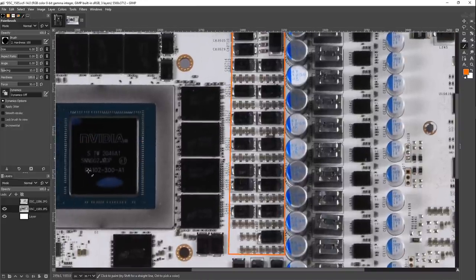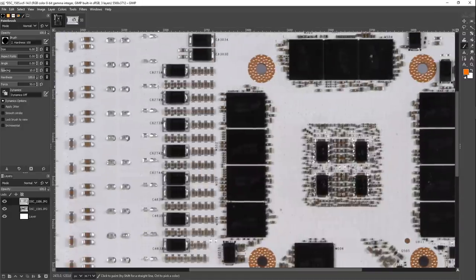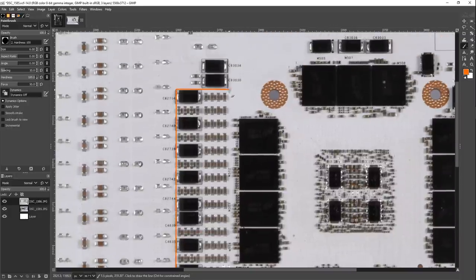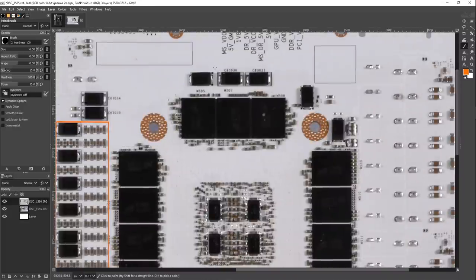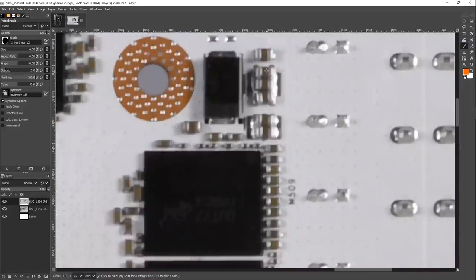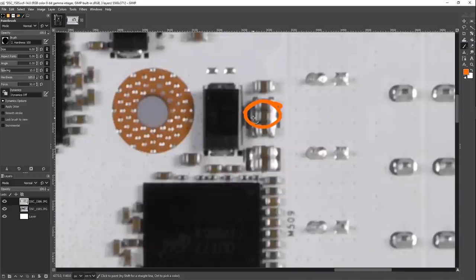We've got all of this on the front of the card, but this is a Hall of Fame card, and it's obviously not enough to just load the front of the card with filtering, because there's space on the back. So what do you put on the back? More filtering. We've got even more SP caps and multi-layer ceramics on the back of the card. We've got some extra filtering for the memory up here, which I'm a big fan of. I'm surprised they managed to squeeze that in there, because normally this padding is meant for a smaller form factor polymer capacitor, but you can also smack a bunch of ceramics on it, like Galax has done here.